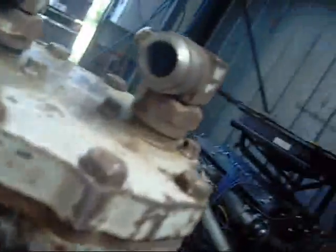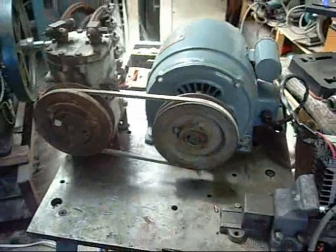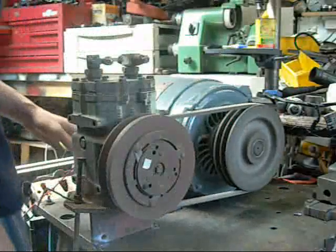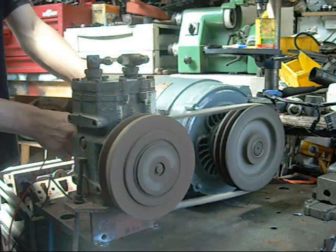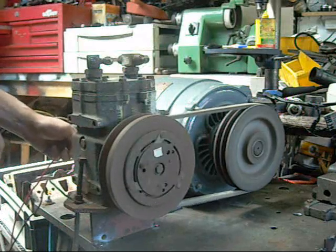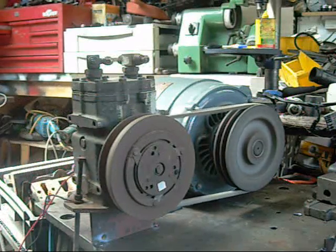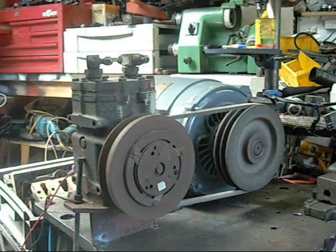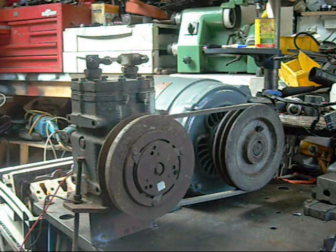King valves are currently fully front seated, so I'll see if she turns over under compression. The suction side will be pulling vacuum and the discharge side will be compressing pretty hard, so I might rub a bit of rust off that clutch plate. Open those king valves up. Okay, this is with king valves open.